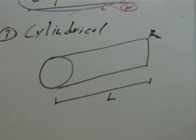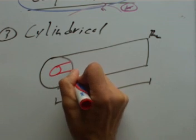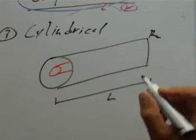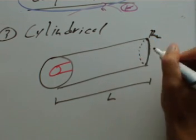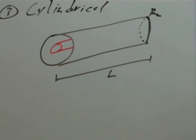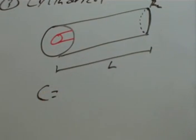Well, inside of this one, we'll put another cylinder that looks like this. Remember, these are all pieces of metal. They are not touching. This is just my perspective right here. And so what do we have again? We have two pieces of metal, and they're separated by some distance. That's the only requirement for capacitance. Here's another example right here. And if I want to know the capacitance of this, there is an equation for this.